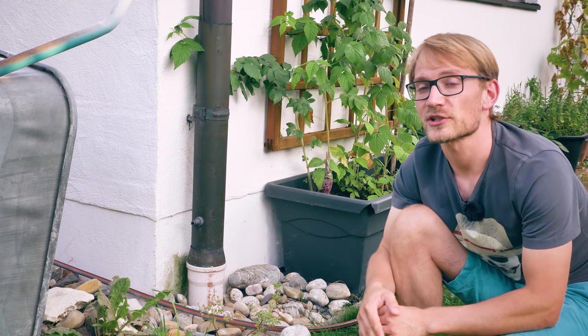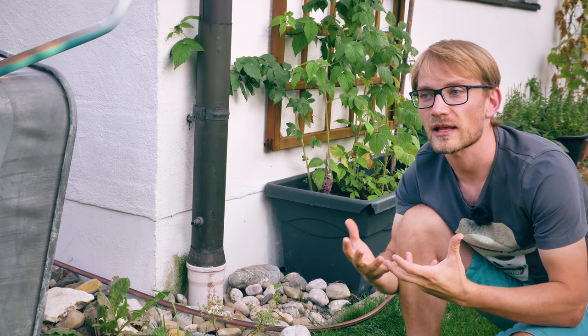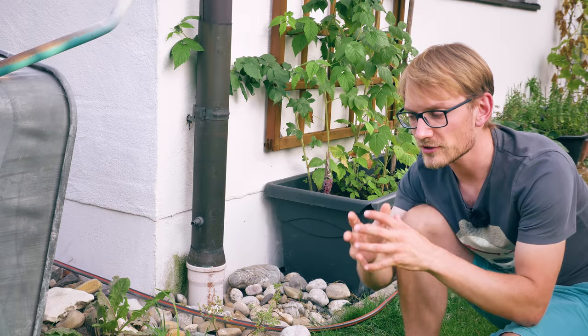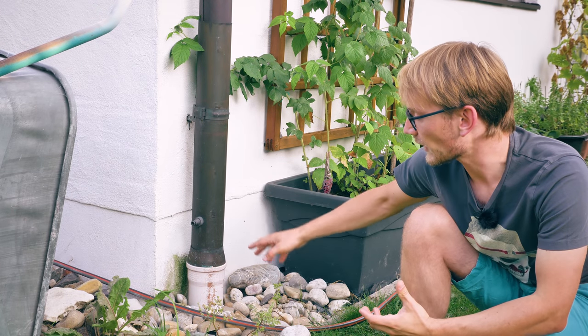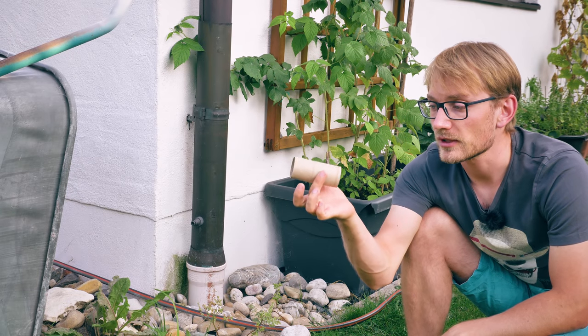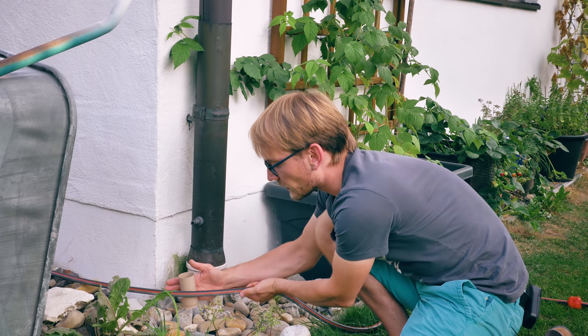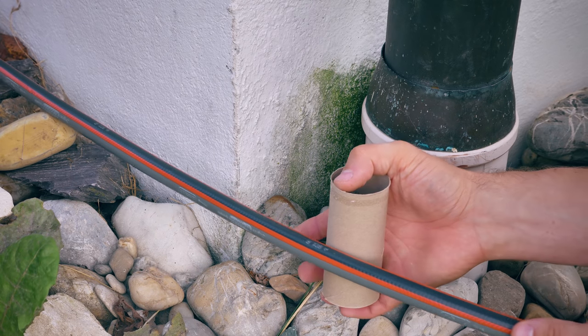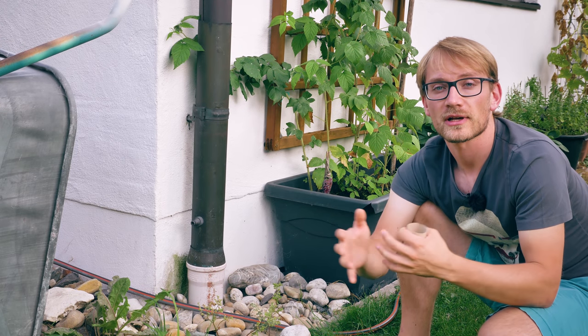I'm going to be designing this in Fusion 360, your standard CAD program. What I find always helps to get you started with a project like this is some sort of scale reference — a physical model you can get started with, because if you just have a blank CAD workspace, it's really hard to get a sense of scale for how large a thing is going to be in the real world. I'm just using the core of a toilet paper roll, because it looks like it's pretty much the right size for a roller here. This gives you some vertical leeway and a sense of how well it's going to roll around the corner. Obviously, this needs to be on a bearing surface so it can actually turn, and since we're outside, we can't use stuff that's going to rust or corrode away.